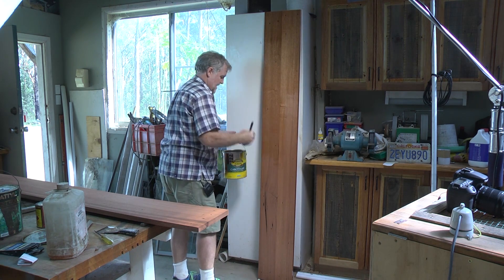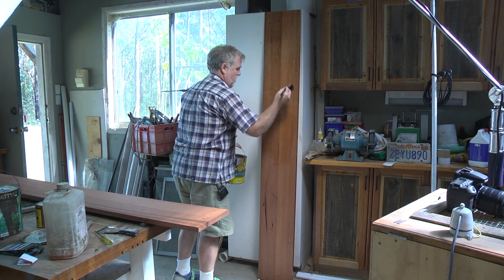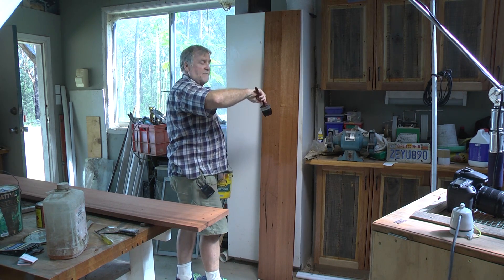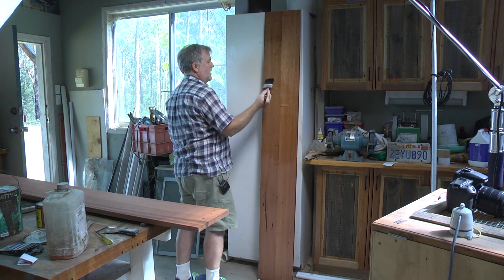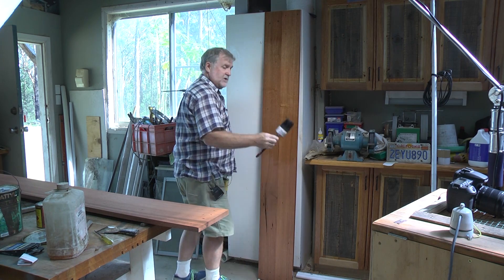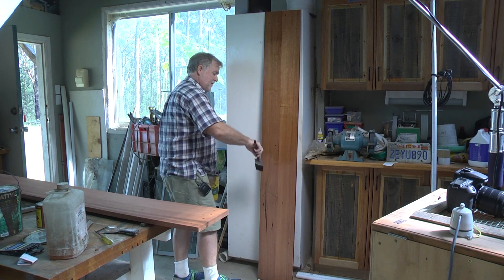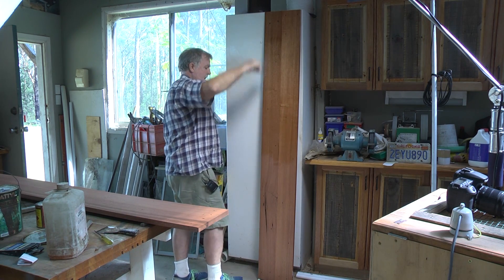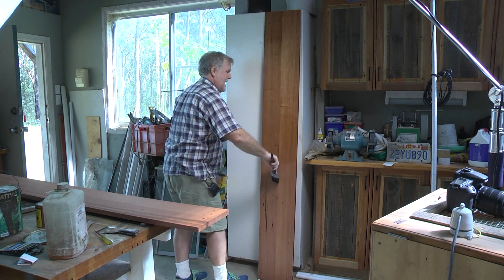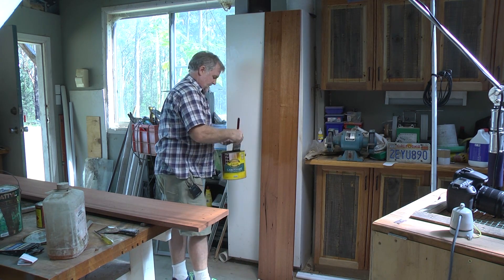I'll go all the way across before I even tip it off. Now we've tipped that off up there — that's done for the first coat. Now, you don't just start anywhere in the middle and drag it down or you'll have a nice big drag mark. You can't see that now, but once it's dry you'll see it. So what you do is you take your brush, start at the bottom where you've ended, and you come up very lightly, going past where you went. As you come up, you bring it off like that. Absolutely not one drag mark, not one brush mark.